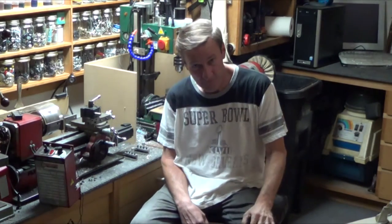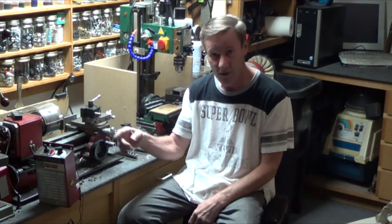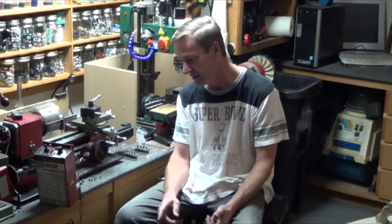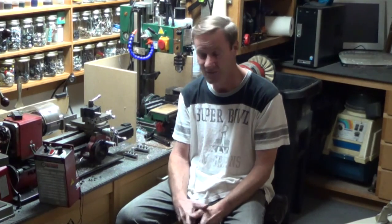I was really looking forward to finishing this video, but I've got a small technical problem. As you saw, the TCMT insert wasn't really breaking the chips — it was giving me a long lead and I had a bunch of them, so they were starting to get in my way. I grabbed them and threw them behind the lathe. The next thing I know, I heard a loud pop, saw a nice little spark, and I guess they worked their way into the motor somehow. Being an electrical engineer, I'm looking at the motor control board and it pretty much took everything out. So I don't have a working lathe now. I saw 110 volts on the MOSFET, so I know everything's gone.